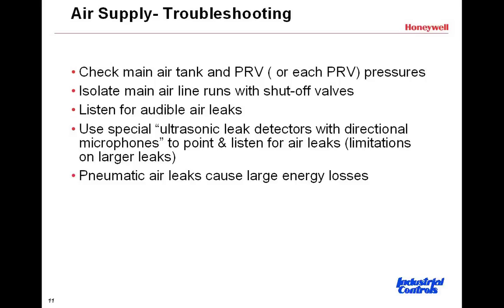Both of our experiences in doing job surveys — listening as we're walking through — is listening to that compressor. Making sure the compressor is running about 33% of the time ideally and not constantly running. If that one-third on and two-thirds off gets reversed to one-third off and two-thirds on, that indicates there are leaks somewhere. It's not always easy to track down, but it's what you go out and look for.